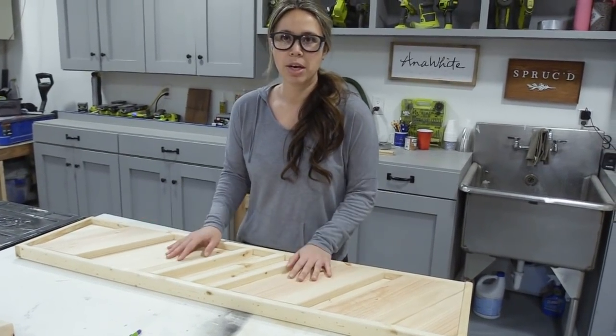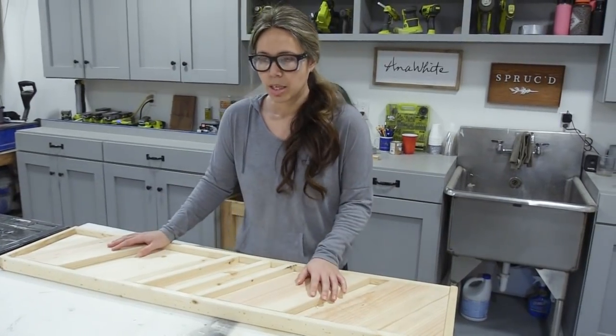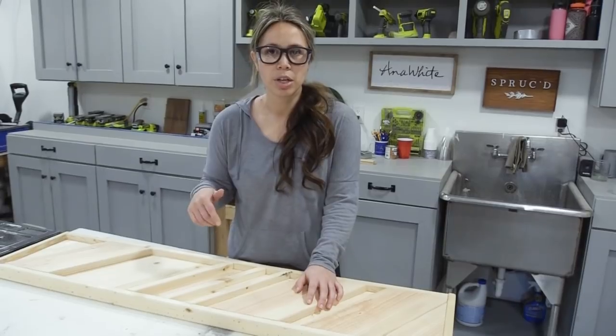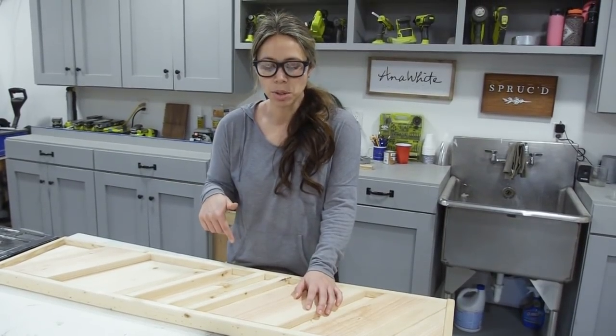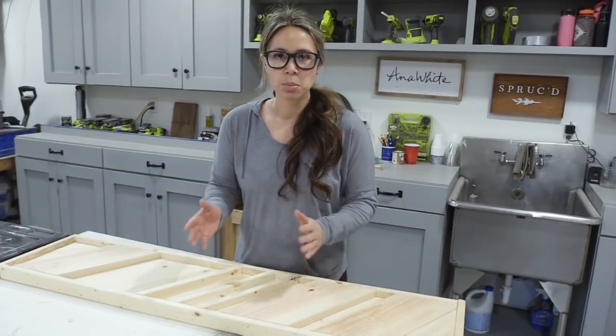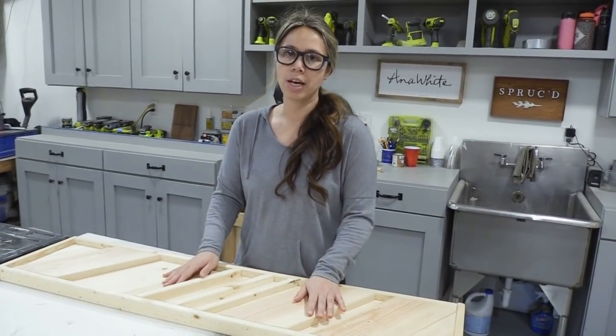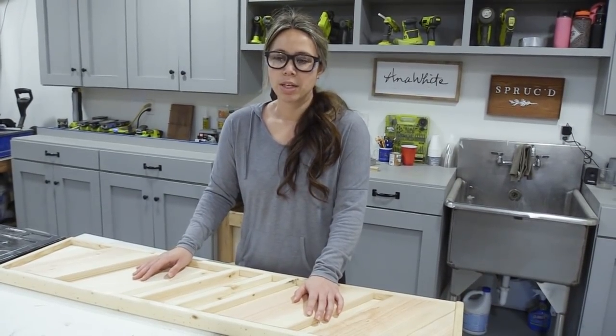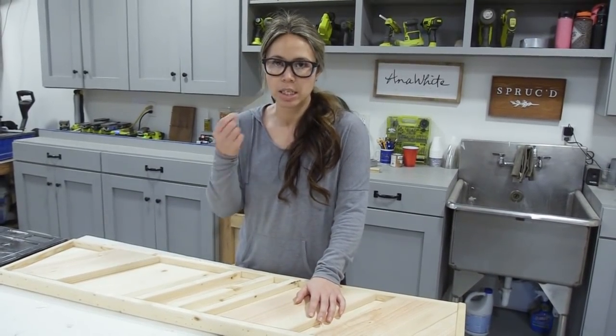There's a lot of debate about how you should stain something so that it is food grade. There's a really good article on it, and I'll link that in the description below, that pretty much sums up everything that I think. But basically, if it's a butcher block top that you are cutting on all the time, you definitely want to go with a food grade finish, so something that you could ingest.